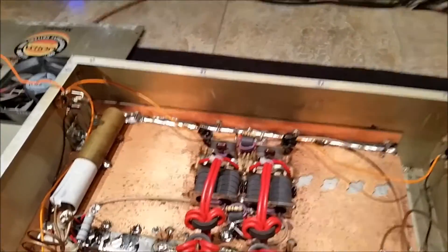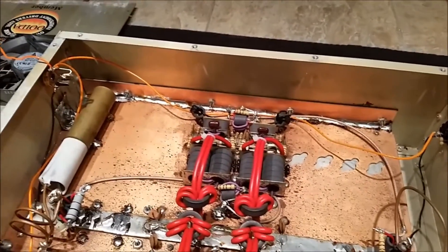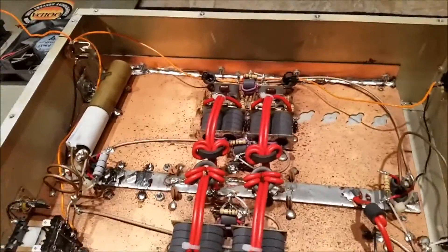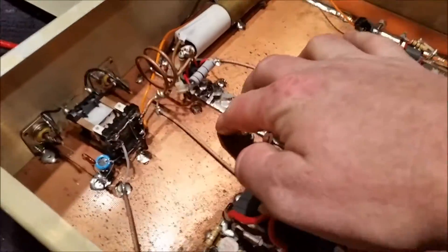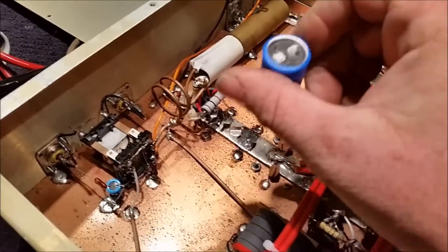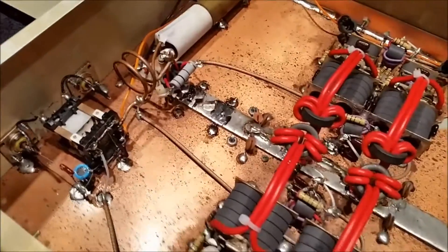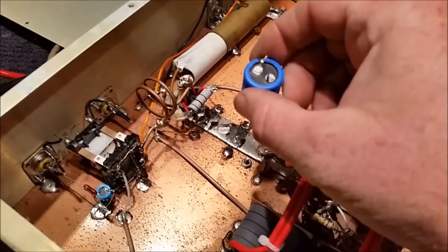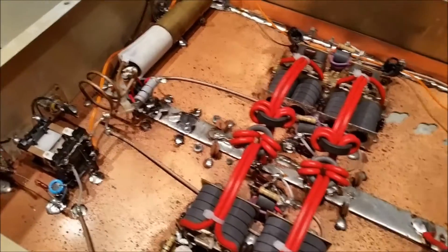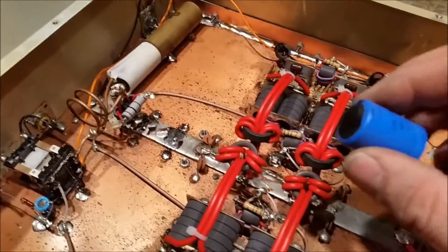I went in and gave him new phenolic strip on both sides. Then I started to look at why it was buckled. Down underneath the board, Joe had added these little capacitors soldered up underneath the board. Just like so — and underneath the board, as you can tell, they're all swollen and puffed up.